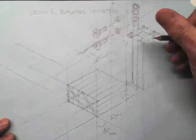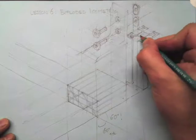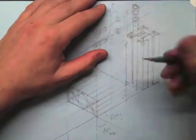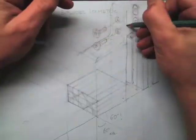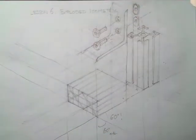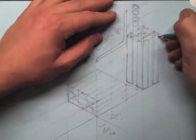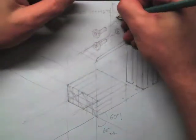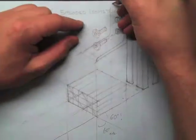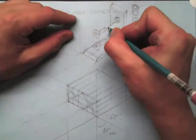And so here I have an alignment that is actually doubled. The center line of the hole in the bracket aligns with the nut. The nut also aligns with the slot in the piece of vertical 80-20 and shows that there is an insertion along that axis as well. It's nice whenever possible to keep things in relation to the order of assembly.